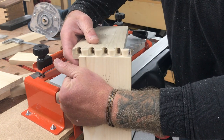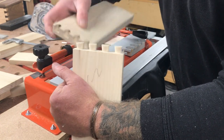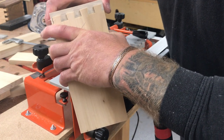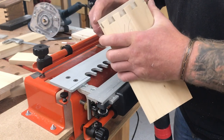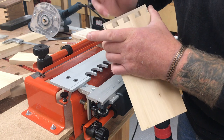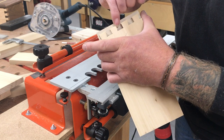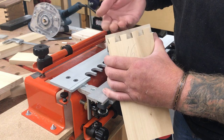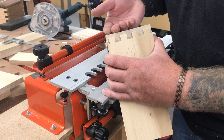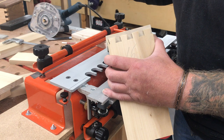So we've gone from that to machining that to a little flip over, and we are so close. You can see that almost wants to go in. But now I just want to make a change. I want to remove more material all round off these dovetail angled surfaces here. And to do that, I just need to lift the cutter a small amount. Half a millimetre, maybe half a millimetre is just too much, but just a tiny amount.